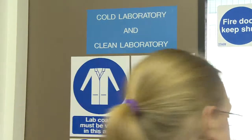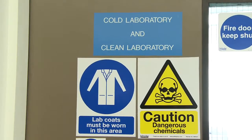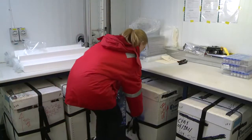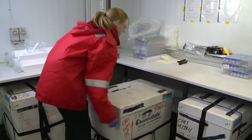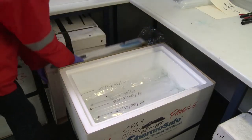Essentially, for the deep cores, there's a drill barrel that's about ten metres long in total. It's got different sections: a section that grips the bit of hole you've already drilled, and then another section that unwinds to drill out the next bit of core, which would be typically a ten centimetre, four-inch diameter core. And then above that there are other sections with batteries and power supplies and so on, and then a cable on the end.